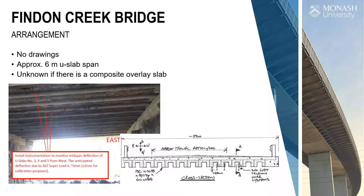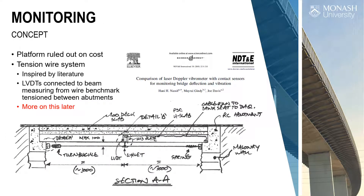These U-slab bridges have a shear key that commonly gets washed out, meaning the bridge doesn't load share well across the width — a real problem if you're carrying all the load in one or two U-slabs. They didn't know if they had this load sharing problem. They also didn't know if there was a reinforced concrete overlay slab on top — the drawings and history of the bridge had been lost. As it turned out, it was fine: it had an overlay slab of about 300mm of solid concrete which shared the load across all the U-slabs.